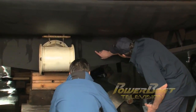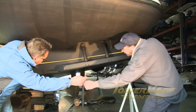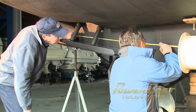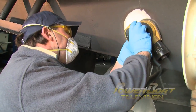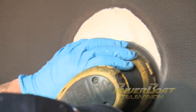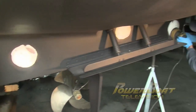Positions were selected for three lights on each side of the stern thruster. When establishing the individual locations, the light should be from 8 to 24 inches below the waterline. With all the locations selected, an orbital sander with coarse paper was used to remove the anti-fouling paint from each LED light's location.